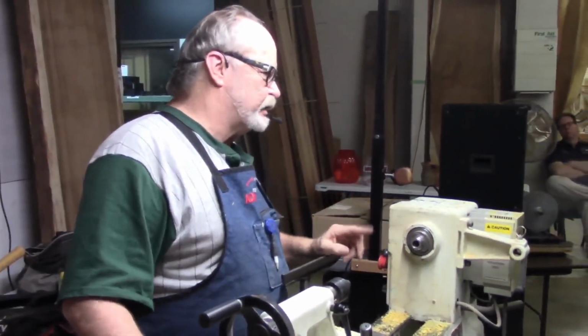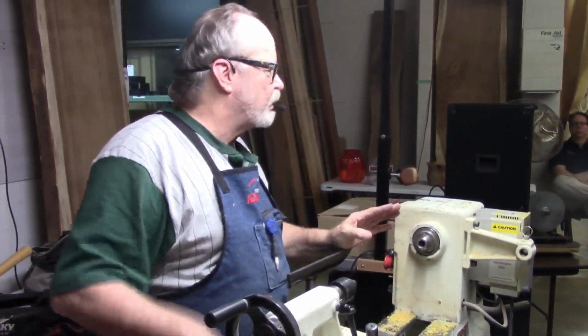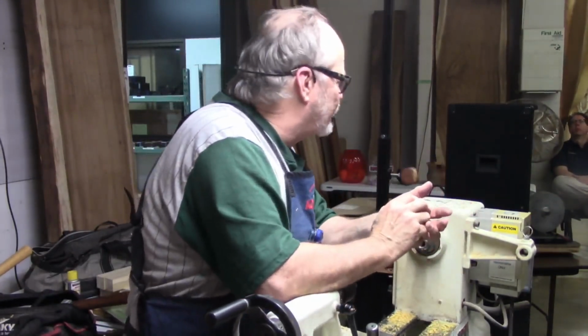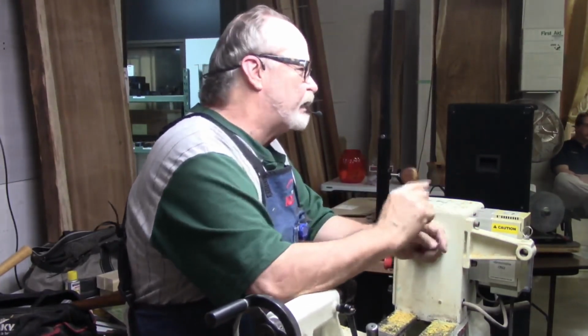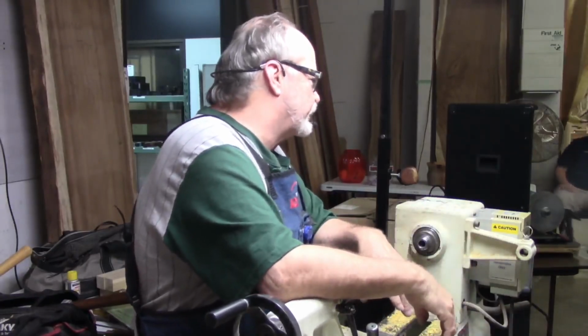It maintains the edge. I watched a professional bowl turner at a conference a few years ago. They asked him in the audience, do you hone your tools? His answer: no, it's a waste of time. I watched him go to the grinder, put a jig on his bowl gouge, and he did that 3 to 4 times on one bowl. And I thought, that's interesting. I would have honed every time he went to the grinder, and I have a sharper tool. So who's wasting time at this point?